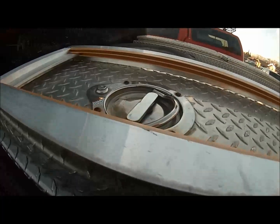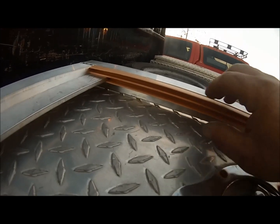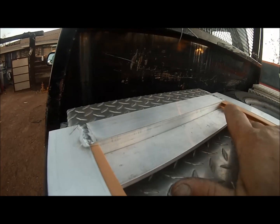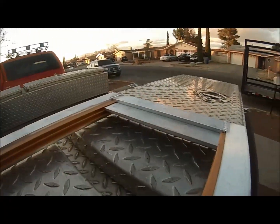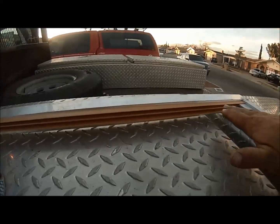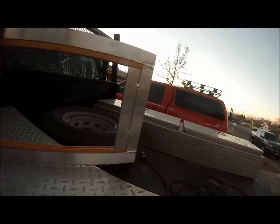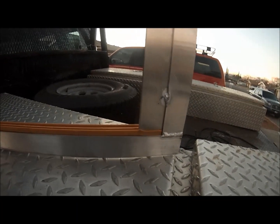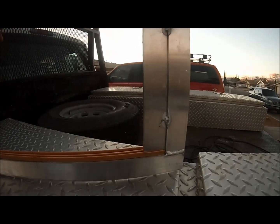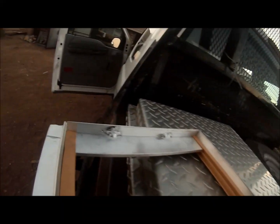Here's the track — it's plastic so I can't weld it directly. What I did is make aluminum spacers and put them inside the track to hold it in place, then just tack weld them in. I put one on each end, offset — one on the inside, one on the outside. Once the glass is in we can weld them up. I've got it welded — just two small tacks — because that plastic started to want to melt. I cooled it right after welding so it wouldn't melt, and on this side I put one in the center.